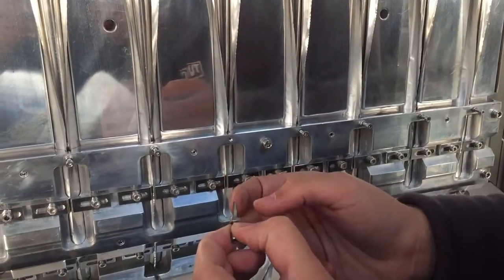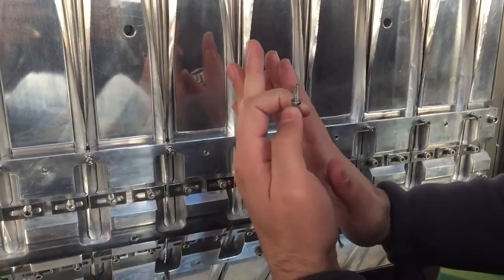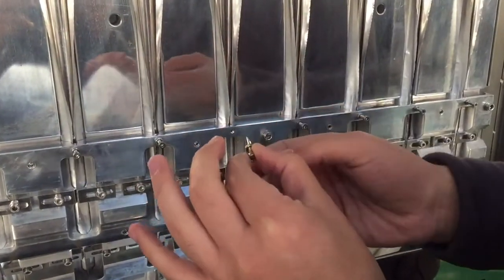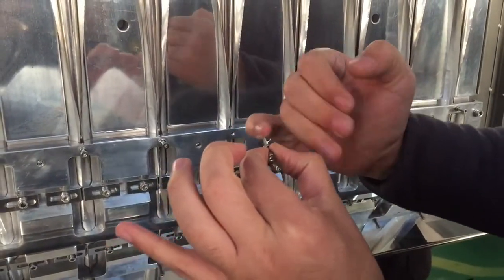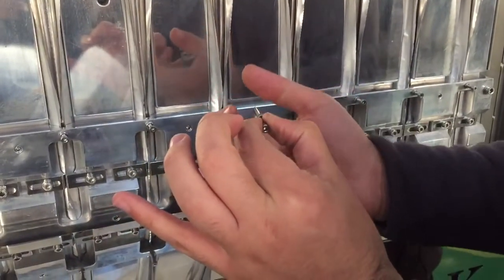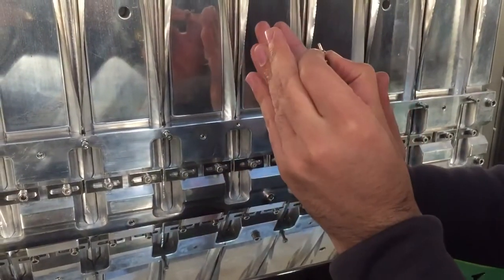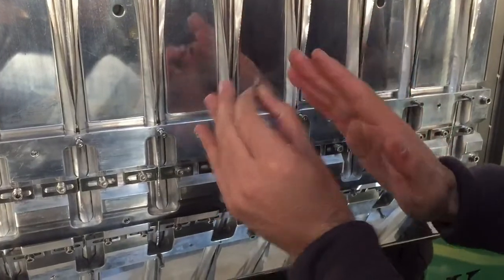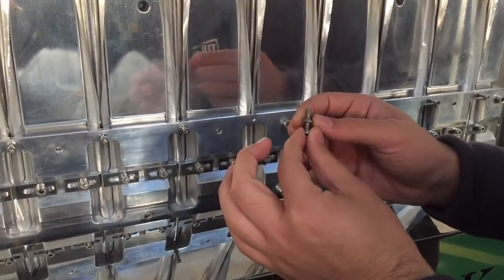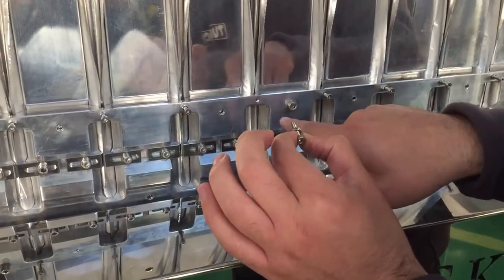So if I have, for example, this side slid more forward than this side, I will rotate this bolt like this in order for this bolt to touch this side and not to touch the other side. So when the bolt touches a side, it will make friction on this side and will make the paper rotate reversely, okay, and vice versa. So this bolt is so much important.